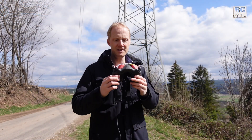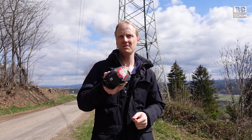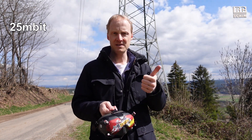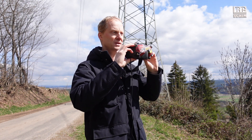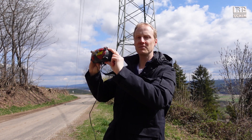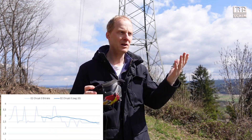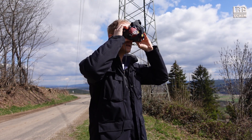Let's begin the testing with the iFlight Crystal, which I like because they are behind the faceplate — they look really nice. Two Omnis, and it's the convenience winner. Settings: 25 megabits, 25mW, channel 1. I will point it straight, 45 degrees, and 90 degrees, recording each, which gives three little videos with SRT files. In the SRTs I see the bitrate and I will average it out over five seconds per clip.